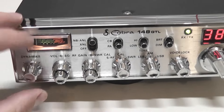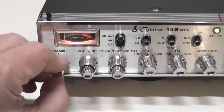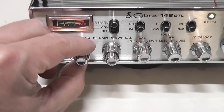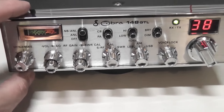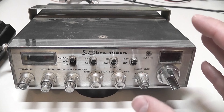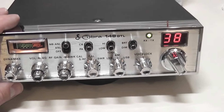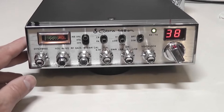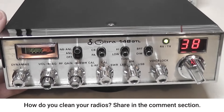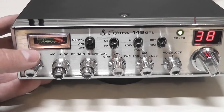We did all the control cleaner into all the pots and everything now is super smooth. It was a little scratchy initially on the volume control and a couple other things, but now working really well — smooth control. It's the difference between something worth $100 to $150 in its condition versus $200 or more once it's all clean; even $250 if it's in better condition. I love to see these radios looking beautiful and clean again. Post up in the comments and tell me what you guys are using to clean your radios. I've been using the same stuff for years but always happy to hear something new. Love to see these radios shine again. Thanks for watching, CB Radio Magazine.